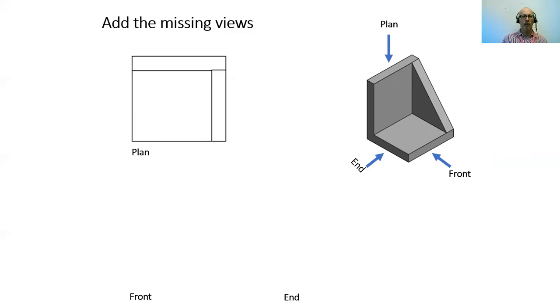And try and line it up as well. Remember that it's got to line up underneath the top view, the plan view. But again, just have a go at it. So what information can you include and what information do you need to leave out? It has to be just a 2D view. Can't be 3D or have any other information on it. A flat 2D view from the front, using very, very few lines. Okay, I'm going to show you the answer, but again, you can always pause this if you're still working.